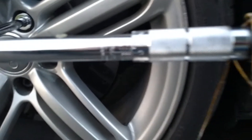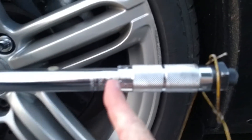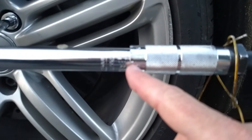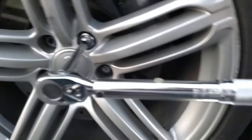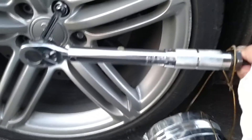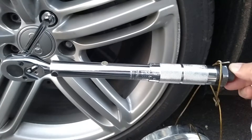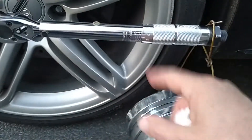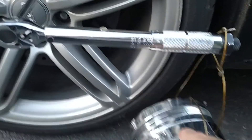You probably can't see it — it's dark and I'm doing the best I can to focus it. But in any case, you'll get that line right on zero and 240. Now if I just barely put a little bit of weight on the end here and push down, you hear it click. I'll hold it back up again and just barely touch this — and that's it. So that matches exactly. So 240 here, this should be on zero and 24 pounds of weight.